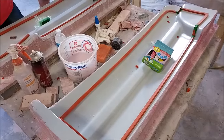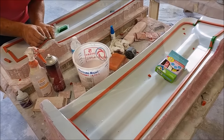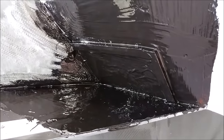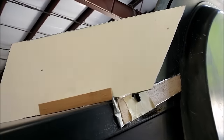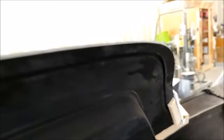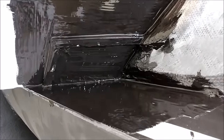Likewise on those floor brace plugs, Devon and Zach were busy putting their silicone rubber profile on those — a little bit tricky because of the way it was flanged up. Here's the roof mold again with the black top coat painted in place. We're essentially creating an extension to the existing mold that will live on the door insert and come off when we release the door insert — one on either side. Starting out with the black and then there'll be some layers of carbon fiber put on there.